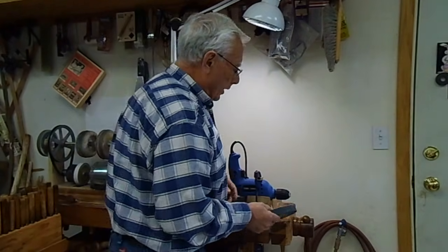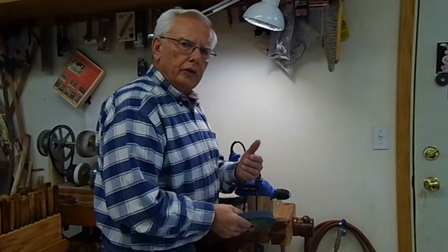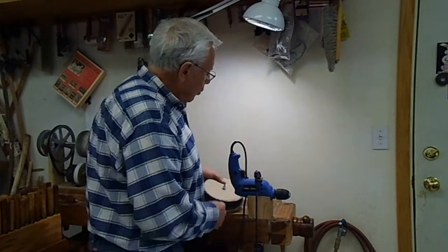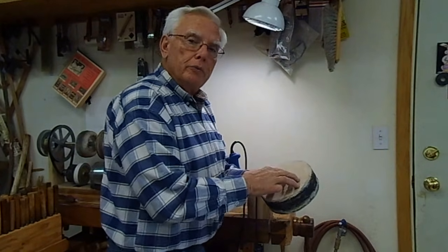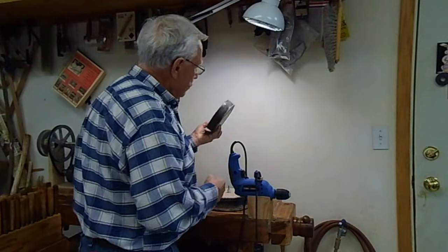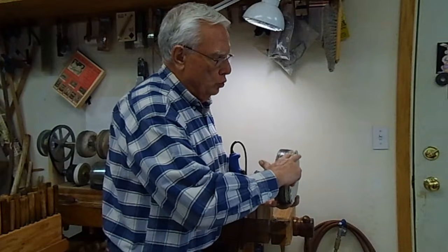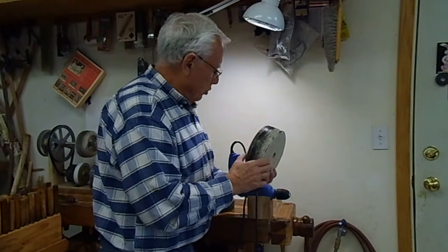The speed is so rapid that it gets the edge of the tool right away over 400 degrees where it will change the temper on it. So when I sharpen a tool, if the tool has got nicks or is quite dull, I start with the grinder. After I get a burr on it with that wheel, I come back with a buffer. This is a buffering wheel made out of MDF board. There's also another type of buffing wheel with a profile in it that I can use for the inside of the V tool — I take the V tool and reverse it. To buff my gouges I have a radius on the edge.